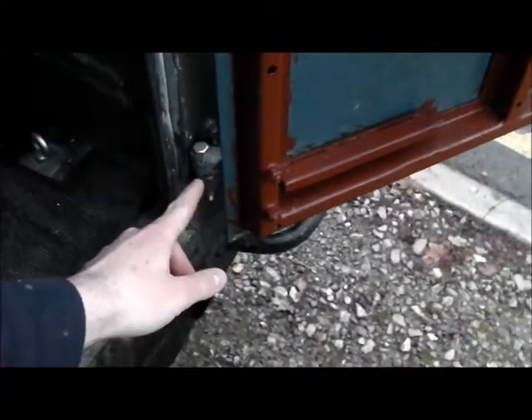I need to make up some brackets for the back, but we'll gradually get there. There's a bit of a swine to get the door to fit — I had to make another ball for that hinge. So you've got a brass one in the top and there's stainless bolts. I've drilled that out for M8 stainless bolts just to make it a bit stronger, and I've had to put a big copper shim in there as you can see to make it latch properly.